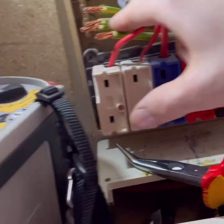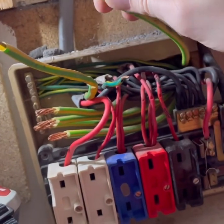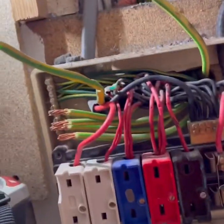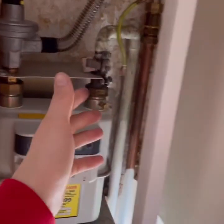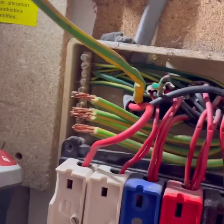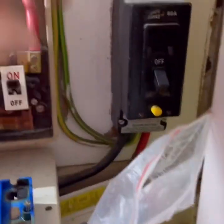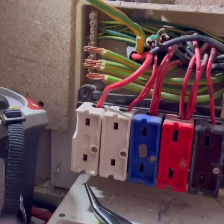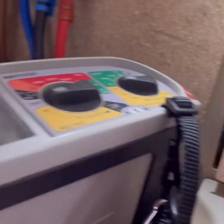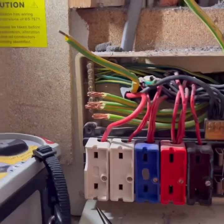There's quite a few — one, two, three, four, five — ten mils. That might be a 16 but I can't see. I can't verify which one is which, so I can't perform my Ze. I'm going to eliminate by process of elimination — I'm going to do an R2 on the gas and the water to eliminate two of them. There's two that come in here into this device. It might eliminate it down to one, but I can't see it. Maybe there's a rod outside. Let me find the bonds and get rid of those so I know what I'm left with.